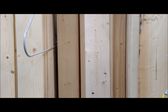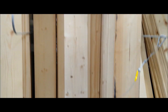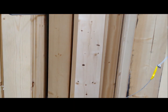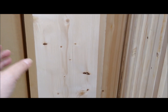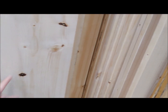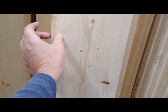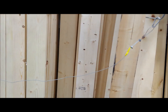Yeah, I like that. All right, I'm thinking I need to get two 1x8x8s. Yeah, 1264, because I want those to be the sides. It's not going to stick out 8 inches, but maybe 7 inches, and we can rip an inch off. And then that can be the blocks for under the shelves. Yeah, I've got two 1x6s already.